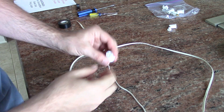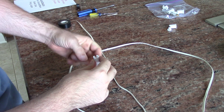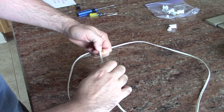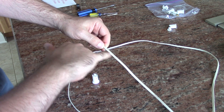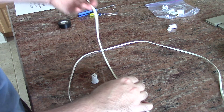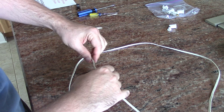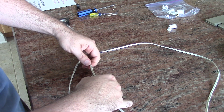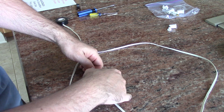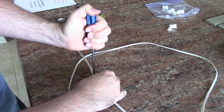I think I've got it all set up. I have the light bulb socket upside down with the neutral prong towards my left and towards me, which is what I want. Turning the wire over — the neutral wire is now facing me. I can feel the groove, plus I can see the markings for the hot wire. I'll move it so here's the top of the wire, going down a bit since it'll sit a little higher now. Past the old marks, down to about here — that looks pretty good. I'll use a screwdriver to push it down, as Dynatrack demonstrated.